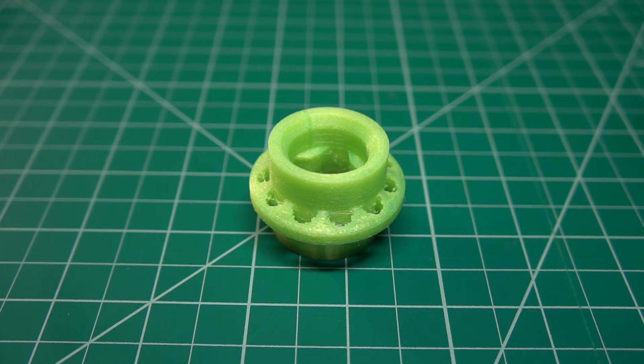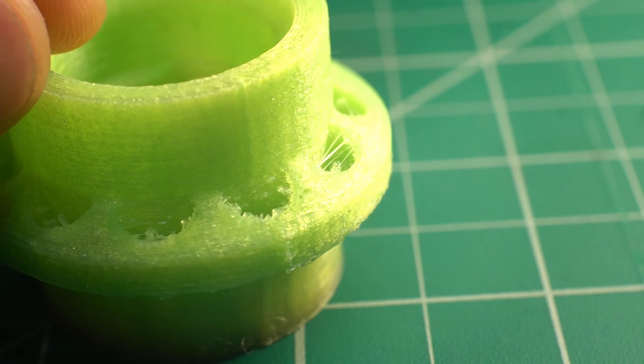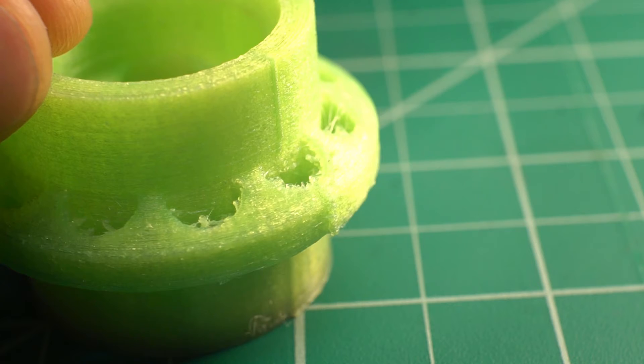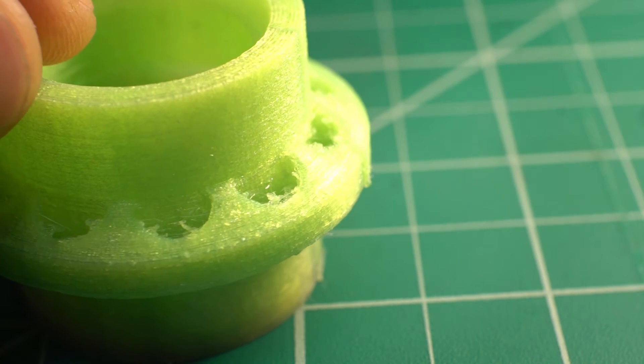In version 3, I switched from PLA — a brittle plastic that deforms under pressure and degrades in sunlight — to PETG, which is much more suited to what we're trying to do here. I redesigned the bearing seat so that it has four waves, in hopes that the plastic wouldn't have to travel as far and reduce drooping on that overhang seating face. It did accomplish that, but not as much as we needed it to. PETG is also a pretty bratty material — it globs and strings, which I really want to reduce because all of those artifacts can affect precision.